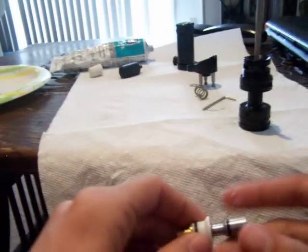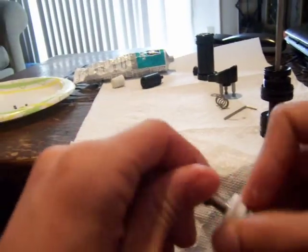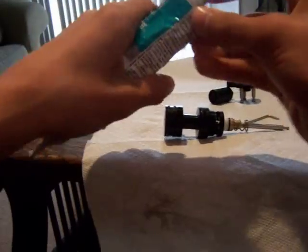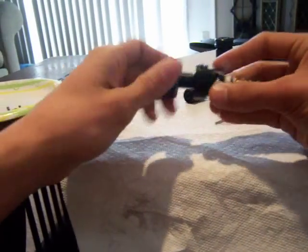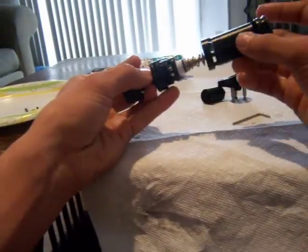Okay. Take a little bit of grease, put it along the poppet, not on the back of the Delrin part. There we go. Throw that on. Put the spring on. Get a little bit more grease. Oops, dropped my cap. And put it on the O-ring on top of the threads. Put a little bit more up there. Throw on the upper can.